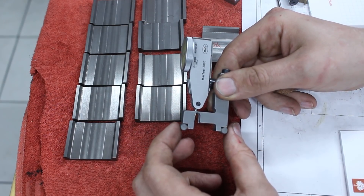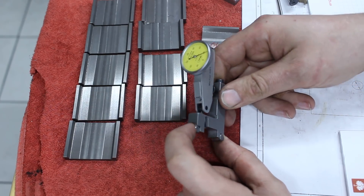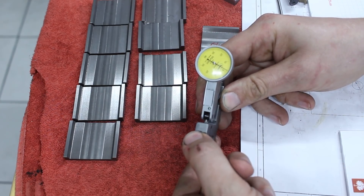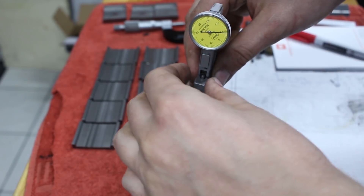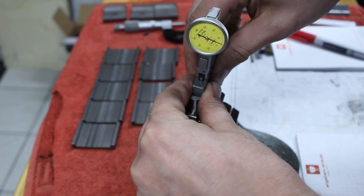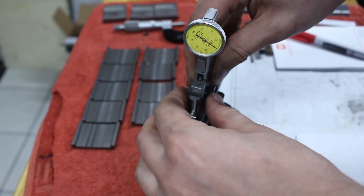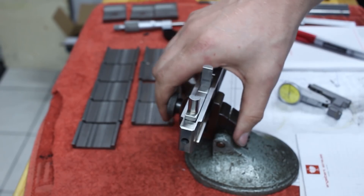The cross section here is very thin — this is a flexure, it can bend. If I push these two parts together, I get a reading on the indicator up here, and that's the whole magic to this device. The way this works is you drop it between the gauge blocks, then pivot it like a dial bore gauge to find your high spot. When you get your high spot, you turn the dial to zero and you're good to go — very easy, very repeatable calibration procedure.